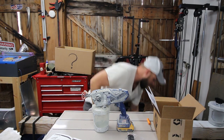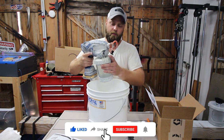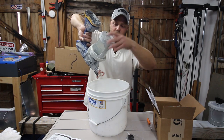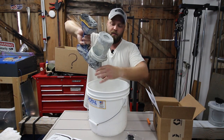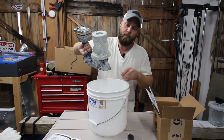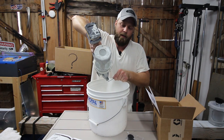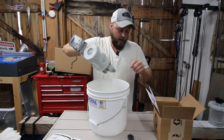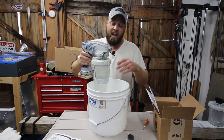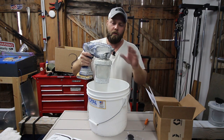I've got water in here and I've already primed it off camera, but it doesn't seal up real good with water. I've got my selector to spray. I'm just going to turn it upside down to try and get it to spray — it's not going to spray. There's a little ball bearing in there and a spring. I can show you that on the parts breakdown in a second, but if I depress that, I can get water and paint to come out. I figured that out because I started having issues cleaning it — every time I went to clean it, it was just harder and harder to get water to spray through.